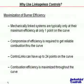Unfortunately, on boilers fitted with no characterizable trim, you really only hit the sweet spot at one point on the curve — across the full range of travel from low to high fire, you're living with a compromise. Going to linkageless technology allows you to hit the sweet spot for fuel-air ratio and emissions continuously from low to high fire, and it's much easier than playing with linkage, where by the time you're in your truck, it's probably working less optimally than it did an hour before.